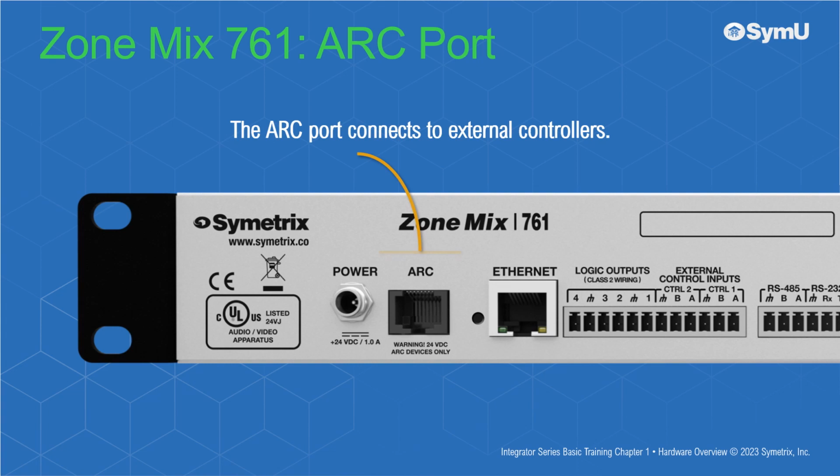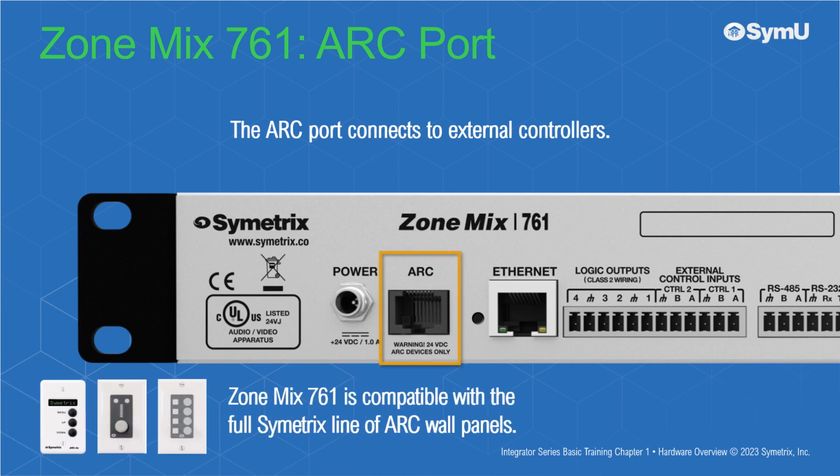The ARC port connects to the Symetrix line of ARC wall panels. Please note that only 24 volts DC ARC devices should be connected via the ARC port. Connecting non-compliant devices can damage the Zone Mix 761. We'll talk more about adding ARC controls to a Zone Mix 761 setup shortly.